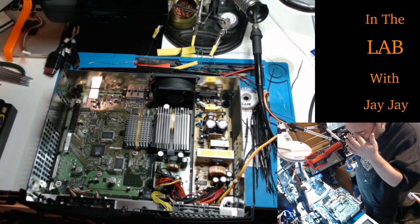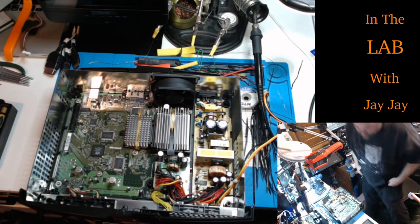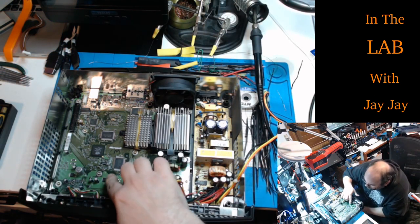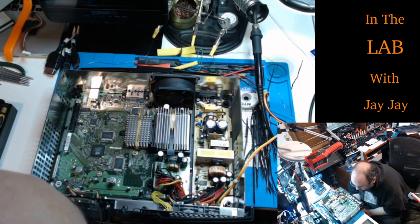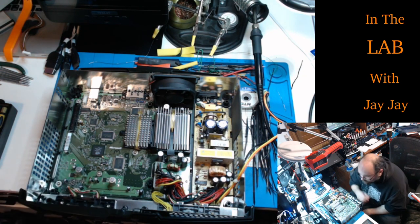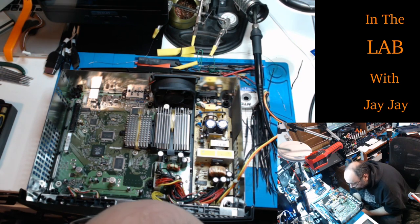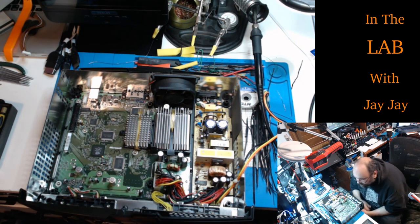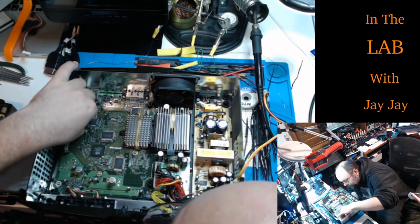Now, this guy hasn't been opened before. All of the seals were still sealed. These are pretty reasonable looking caps, actually. So, I was expecting... Oh, look, it's a V1.6 board and the big 2 farad or 1 farad cap is over here on this board. So that's what we're dealing with. We'll replace him as well, why not? Although he does look like he's okay, actually.